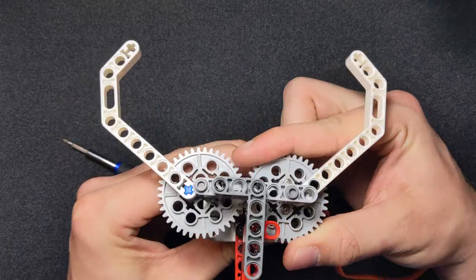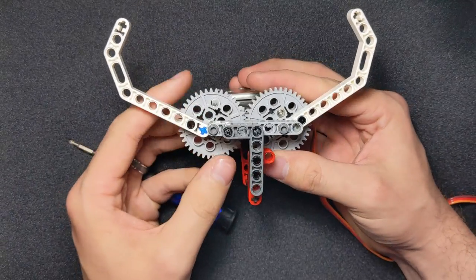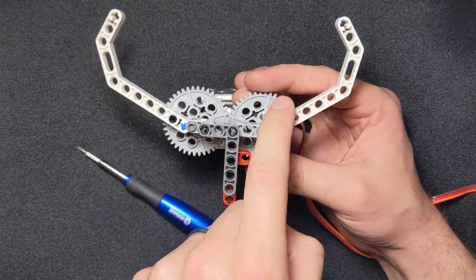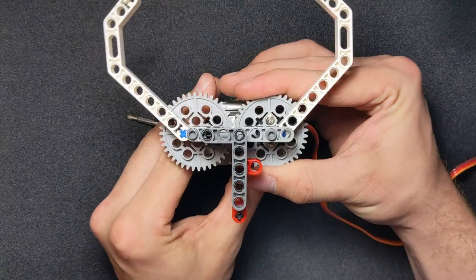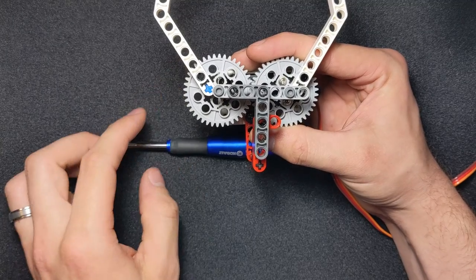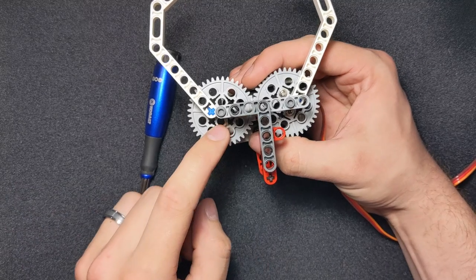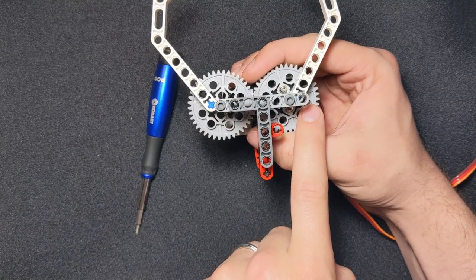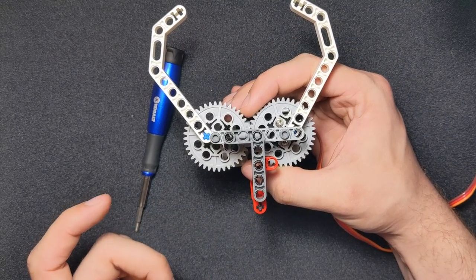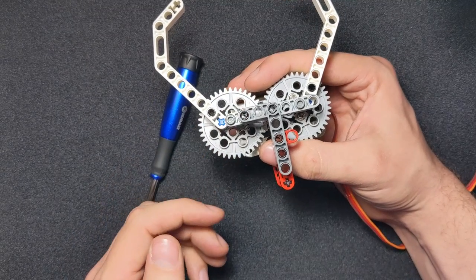If you rotate this gear, it opens and closes. Just to go over why this works: whenever you move this gear inward, it pushes the other gear in the opposite direction. The number of gears in a claw matters a lot — if you have an even number of gears, the ones on each end move opposite each other. If you have an odd number, they move the same direction. We'll go over that in a different video, but that's the reasoning for why we only used two.